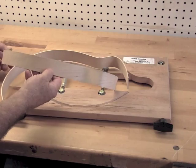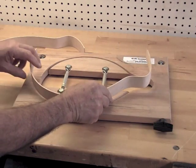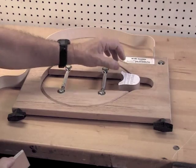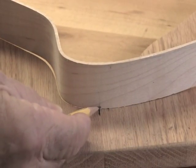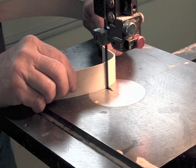Here's a set of our steam bent A-model ribs for the A-model mandolin. As you can see, they fit in the shape of the fixture itself. The next job is to check where the head block and tail block go and how they're going to align to everything, and then we're going to mark the center line where the neck goes so that we can cut that line on the bandsaw in the head block area.